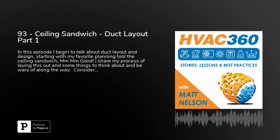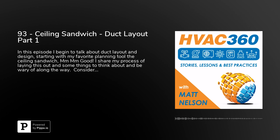So one last thing, if you can at all run round ductwork in your ceiling space, just remember, if you're running it out to a diffuser, can you actually turn that 90? Can you turn a 90 in the ceiling space? Because obviously that 90 is going to be more than just the dimension of that ductwork. And like what we talked about last week, if you turn that 90, is that going to compress? Usually that's a flex duct. Are you going to compress that flex duct so you can add additional static to it? So does that fit properly?